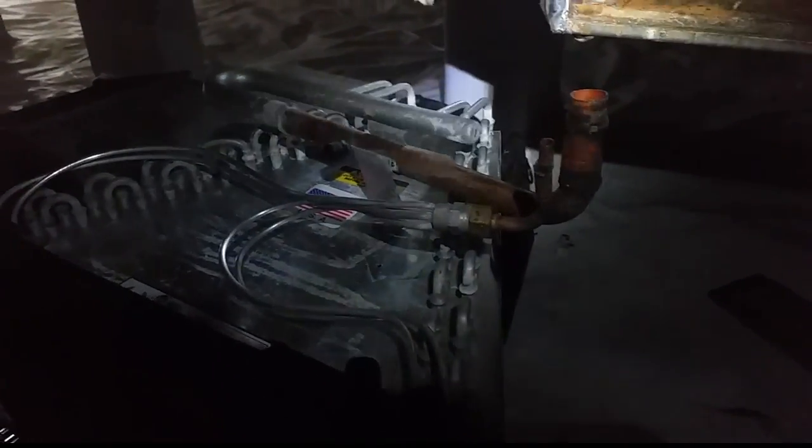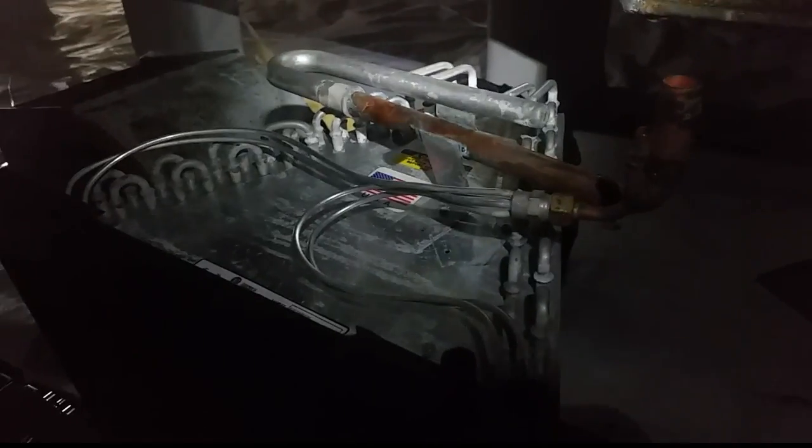Using my special drain removal tool — fits every size drain. Our air handler is taken apart. The blower was right here; three screws and it just slides right out. The coil itself is an aluminum coil — it's a replacement coil made by All Style. Evidently All Style started replacing the original Ruud coils. The original coil had a TXV; this one has an orifice. I did not put this coil in — I would guess they were supposed to add the TXV but they didn't. Coming out now.